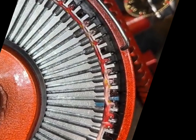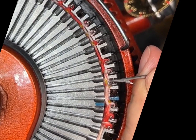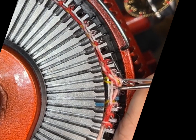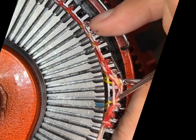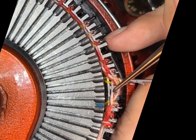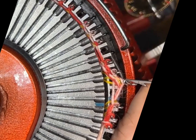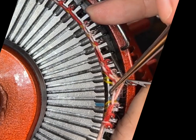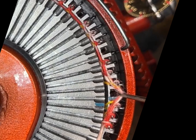All right, so on the right side, the first cylinder needle, I'm going to pull it out and let's have a look. We should have 3 bars. Of course, I see 2. Yeah, there's 3. One's on top of the other, just to confuse us. You see that? 1, 2, 3. So with my stitch tool as an assist, we're going to poke it down there, and I've got to trap all 3 bars. There they are. They're all happy.